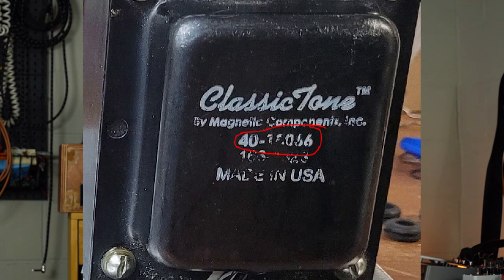Even the plate voltage was really, really high, which is going to create a problem. You know, EL84s probably want to be more in like the 350 range. I think you might see some amps that run at about 400, but 450 to 500 is way, way too hot. So something wasn't right. And what I discovered upon closer inspection was my power transformer. The lettering on the side was a little bit scuffed off. And so actually, I had incorrectly numbered my power transformer.